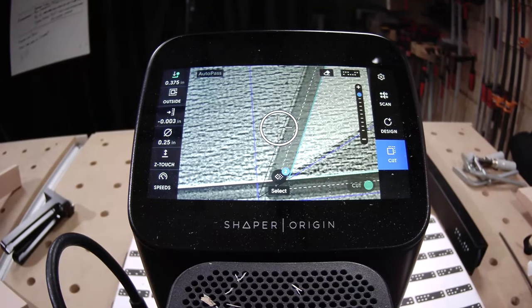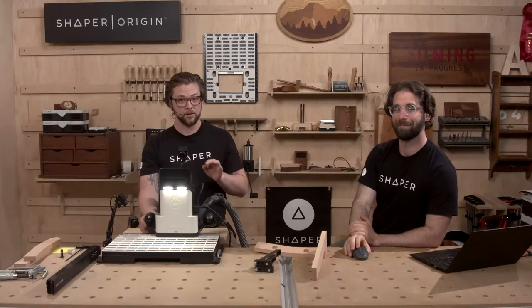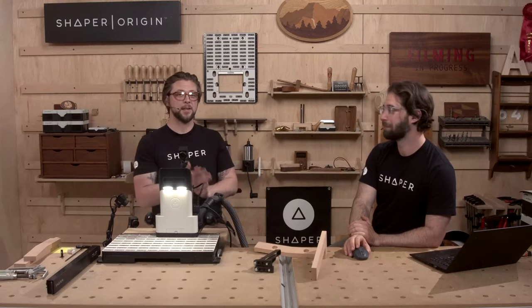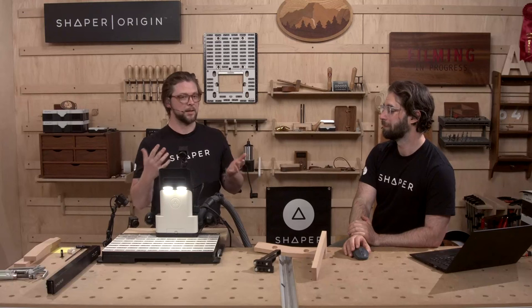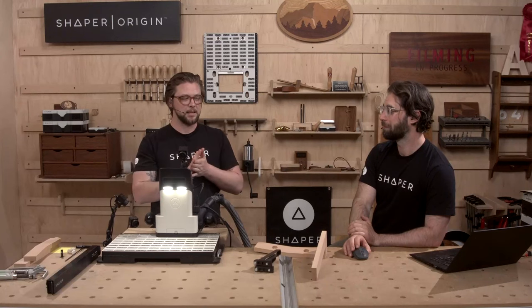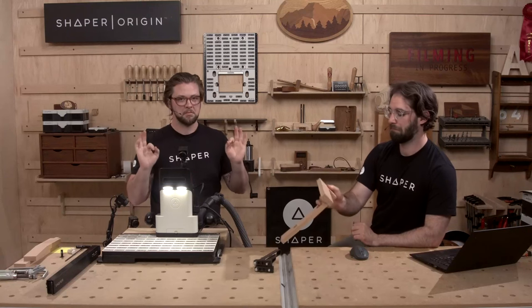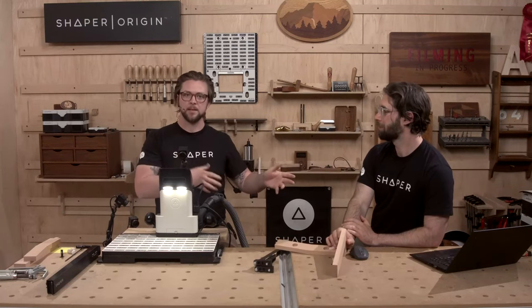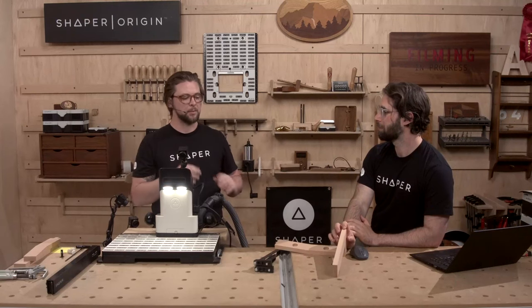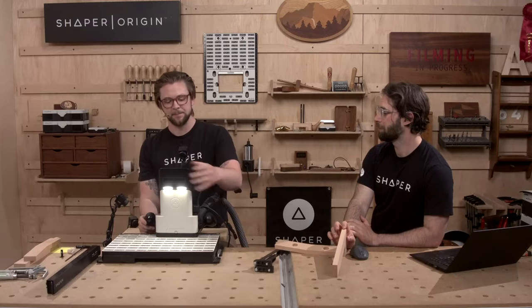Yeah, nice. Now, here's, and Leah, please chime in if I'm going to do this wrong, but I'm thinking I'm going to put like a negative 3 thou offset on both parts, just to ease any interference that comes together. Yeah. That sounds great. Okay. Normally, we do negative offset on one piece and leave the other true to size at zero. But for this one, because it is more like a puzzle piece, I think it'll work out. Okay. Nice. Let's hit it.